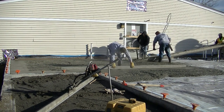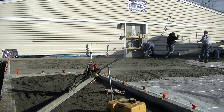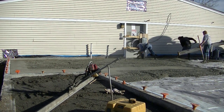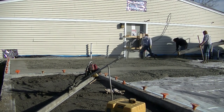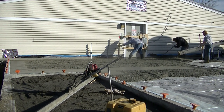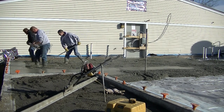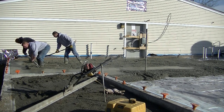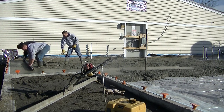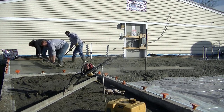This was about a 1,400 square foot concrete floor — it's going to take a couple of trucks. When we have two trucks, we usually like dumping the first truck right out and getting them out of there before we start doing any straight edging. I'm shooting my grades with the laser and my grade stick, making sure everything's nice and level. I use the Topcon RL5B laser for shooting all my grades — I'll link that in the description. I think that's the best laser for pouring concrete.